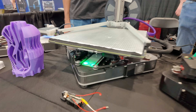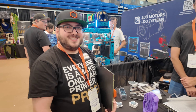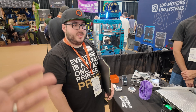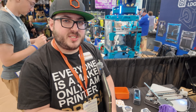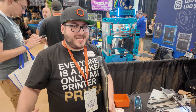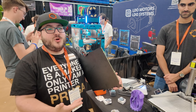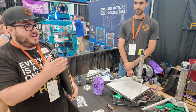That price will have a big asterisk — it's always subject to change, but it's pretty cool. When you make a printer bigger, it doesn't get that much more expensive because you're reusing a lot of the same components. A printer at 250mm uses the same number of motors as one at 350mm. One of the biggest costs on the Positron was admittedly the glass bed — it was expensive and glass is really hard to scale up. So we're not going with a glass bed on this; we're going with a PCB bed. We thought about using an AC bed, but people are unplugging this thing — so that's a terrible idea. We're sticking with a PCB bed.